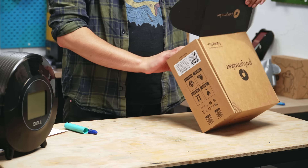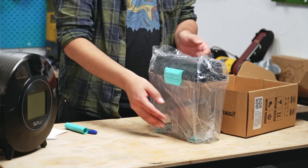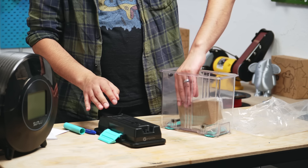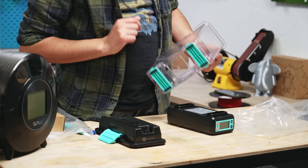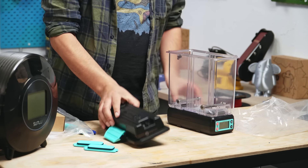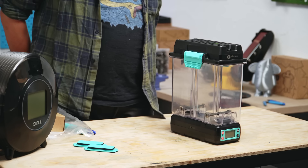The design is compact. It can only hold one spool, the max size being 205 millimeters in diameter with a width of 78 millimeters. It is modular, so there is some assembly, but it's really just slotting in parts and literally only takes a moment. Because it is modular, you can use the box as a standalone dry box. It has airtight covers where the warm air inlet is at the bottom, so you can use it as airtight storage after drying, and if you want to get another box for another project.